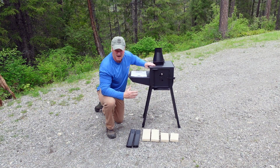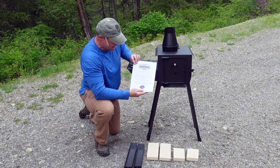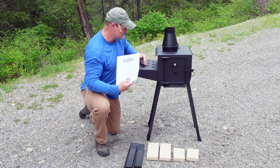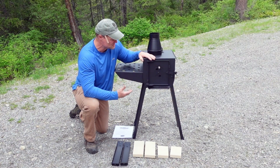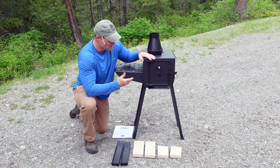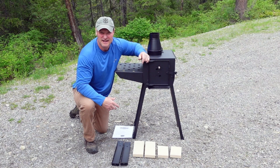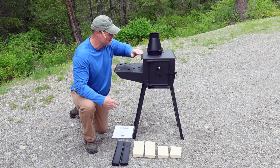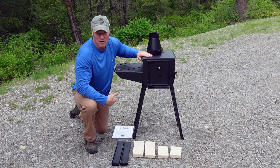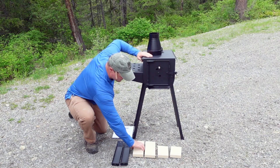This stove is a lot thicker and heavier duty than the Camp Chef - American made and solid, like a real wood stove. It's the Survivor camp stove made by England Stove Works, who make very high quality stuff. What we're going to do today is a burn-off to burn the primer and paint off before installing it in the cabin. I'll also put the first length of six-inch black pipe on as well. After buying the stove, I saw their owner's manual and picked up some accessories.